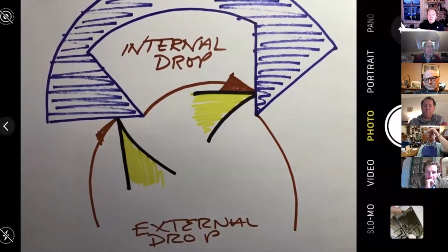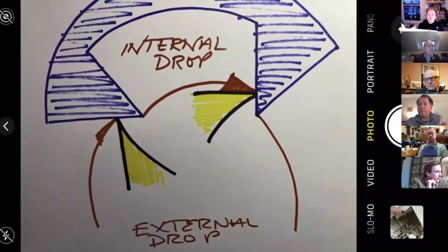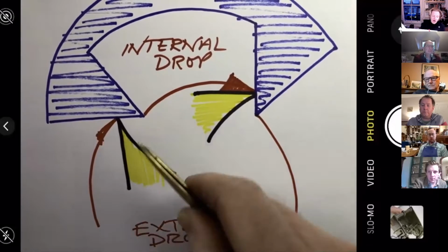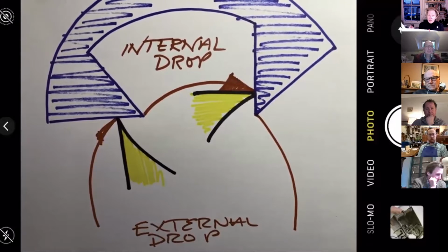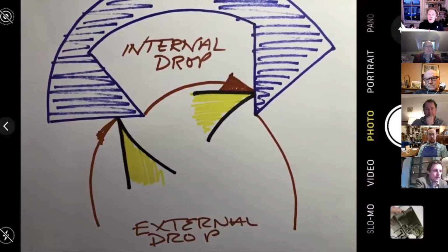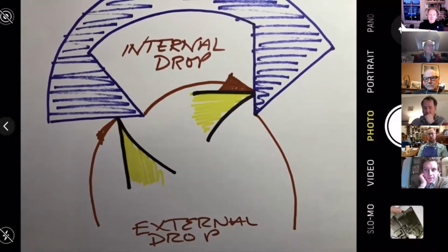When these components wear, either the pallet face and/or the escape wheel teeth, eventually this value and this value here increase, the drop, which as we've talked about plenty of times before, is lost energy. It's the train, the weight, the spring, everything's moving but not doing any work. So we want to, within reason, without getting obsessed about it, reduce that drop. One way is not polishing wear out of the pallets in the first place. The problem is we often find clocks where people have already polished out wear, which I think personally is a problem, but we'll deal with that at the conclusion.